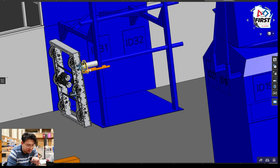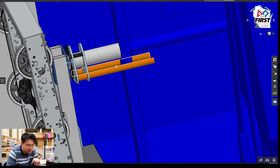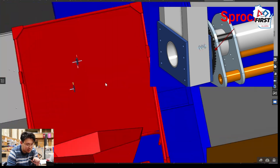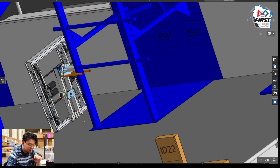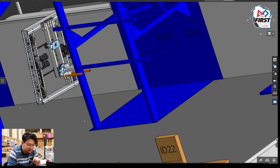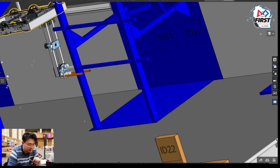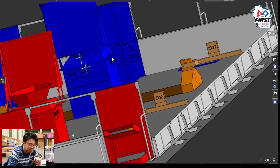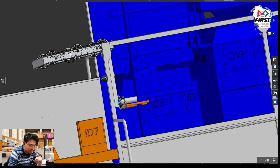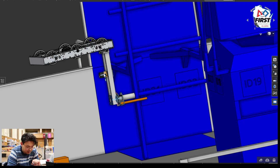After that, as you can see, we have these two little poles which provide leverage against the vertical posts. We have a sprocket here to transfer torque into those poles, allowing us to perform the motion of inverting the robot. Then after it's fully inverted, all we need to do is re-extend the joint, and this gets our bumpers fully above the mid-rung — and that counts for a high climb in a pretty unique way.